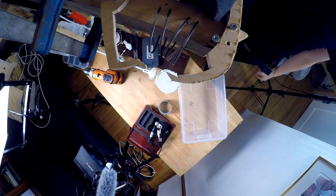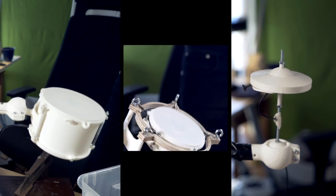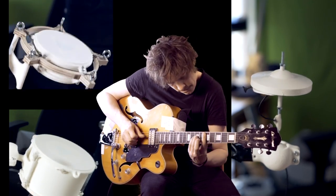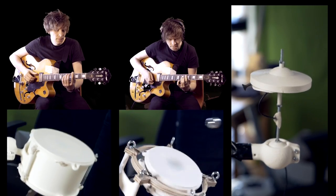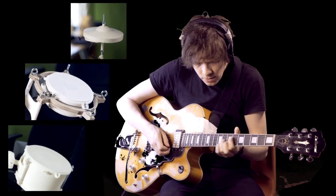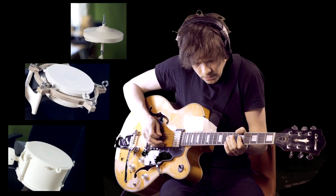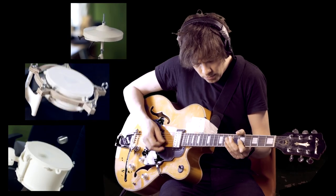There are a lot of improvements I can do to these drums to make the clean sound of the unprocessed contact microphone much better. I have a long list of improvements that I will cover in an upcoming video. The drum I was least happy with was the hi-hat — that transient sounds more like an electrical error than an actual hi-hat. I already have a plan to solve that: we're gonna put rice in the hi-hat as well, so you have a longer sound instead of this super short tick. A lot of improvements still, but as you can see, the 3D printed drums will work and they feel like a fantastic addition to Marble Machine X.